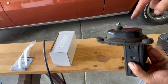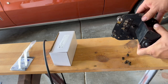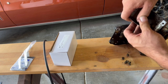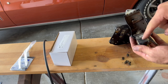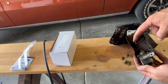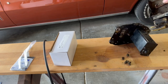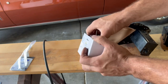The cam would reside on the back side of the wiper shaft — it slides on and has a key so it stays indexed. The reason it typically breaks is what it hits against — it bumps against this lever, and that lever is seized up 100%. What happened is this malfunctioned, rusted, or something, and engaged the solenoid which would kick this arm down. But it blew the cam apart because this lever was seized. That's why I've got a new one right here.